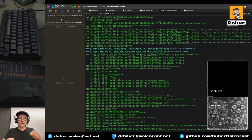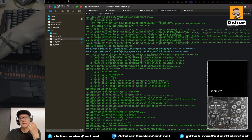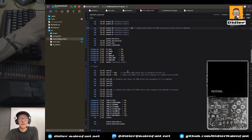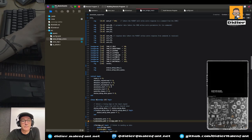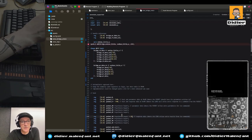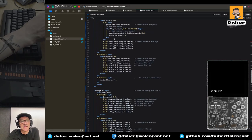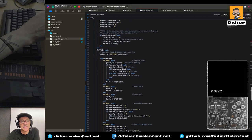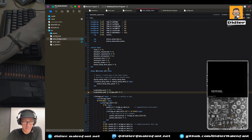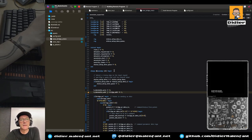Okay. I mean, the other thing I don't like is this is not being set to anything initially. So what's interesting is the bridge stuff is what is setting the reset pin. So every other module that tests reset n, it's being set by this. And so this cannot use reset n to set its value, so it's using an initial block, which I'm still told by some people is something that should only work in simulation. And I've actually seen a bug in one of my old demos where the initial code was not being executed correctly.